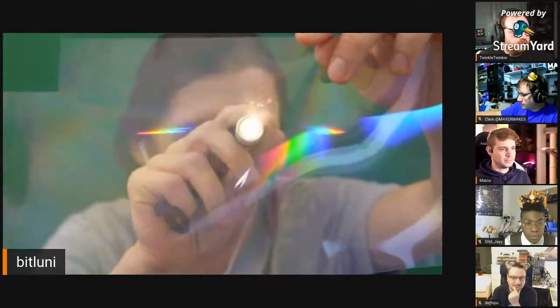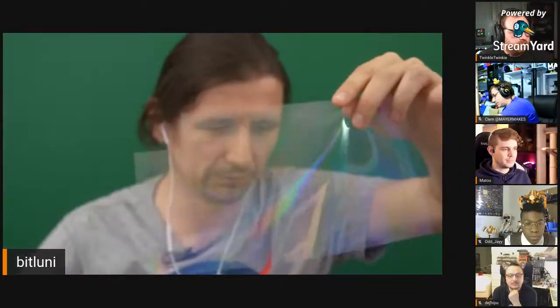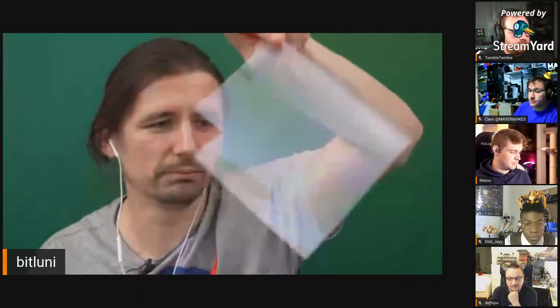This is an incandescent bulb, so you have more or less an equal distribution over the complete spectrum. If you take LEDs, it is not so even. You can get this for really cheap on eBay and AliExpress and whatever. Or you take a DVD and use it as a mirror, and this way you can spread the light, and with an image sensor you can simply record and display the intensity. As calibrated, you could get the wavelength over the complete spectrum.